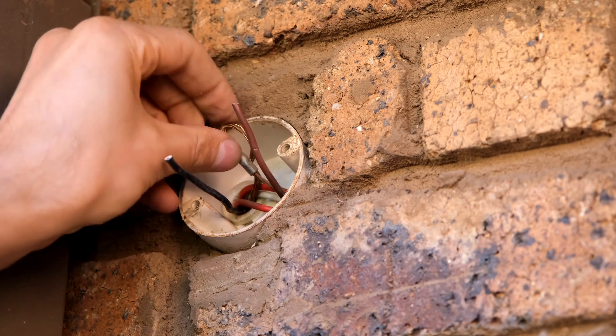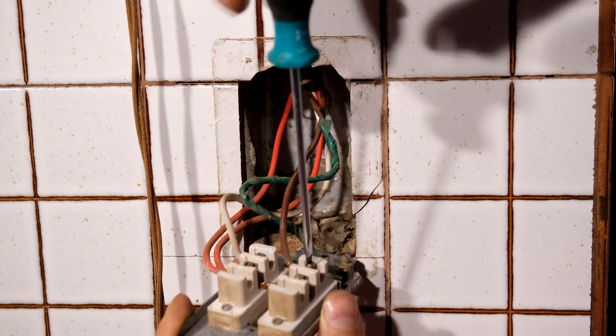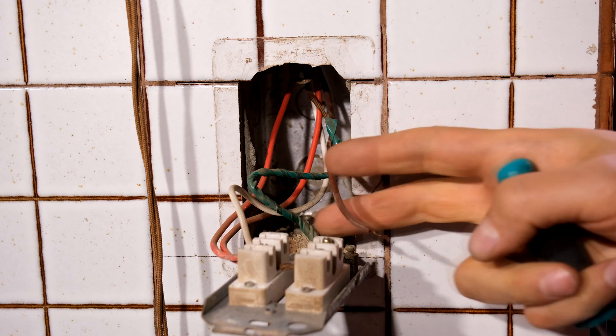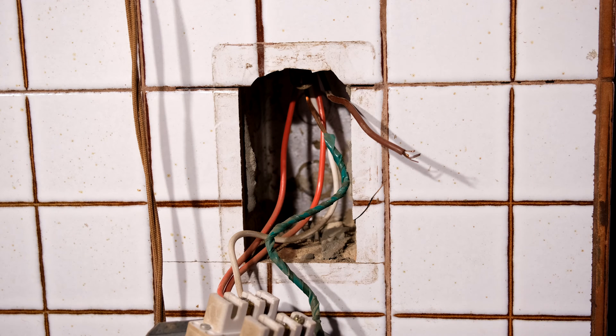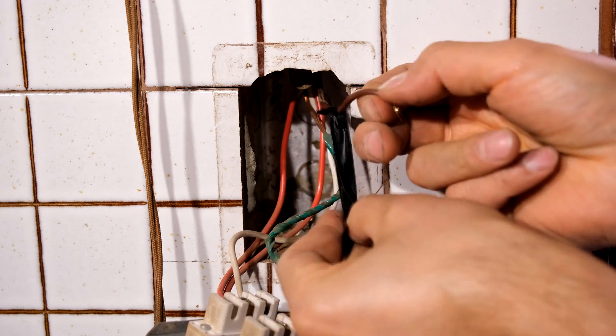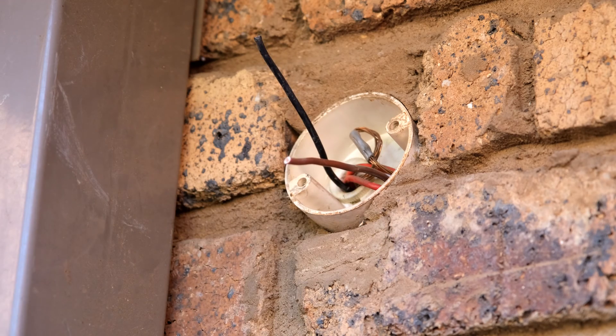The earth I don't need — I can just push it to the back. To recap: there's the circuit I need, but this brown wire is the one going to that outdoor light. I don't need it so I can remove it, and there is a spare wire which I can now run as a neutral wire because I've located the closest neutral which happened to be by that outside light. So here is this brown wire which I'd like to now re-thread as a neutral wire to that neutral point where that outside light was. If you didn't have that outside light you would have to thread this into your ceiling or to a nearby neutral point. Here is a neutral wire — you can see the colour is black. You don't have to run a whole new wire like I'm doing, but because I'm showing it in a video I've got to do it properly. Lazy people would just tape this in black on both sides to signify a neutral wire, but because I'm doing the video I'm going to do it properly.